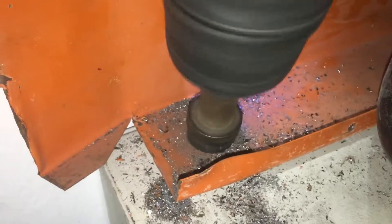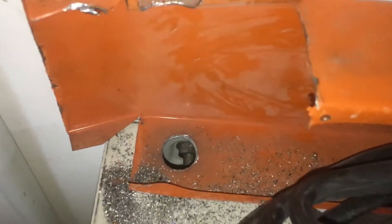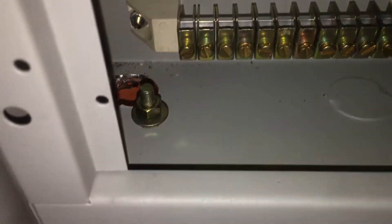That's the clean 20mm hole cut. Make sure to clean the debris from the drilling holes. Next, drill holes inside the wiring trunking together with the three-phase distribution board panel, then drill a hole into the single-phase distribution board panel at the side. Before installing the single-phase distribution board, make sure the drill holes align properly so the main wiring is easy to run.